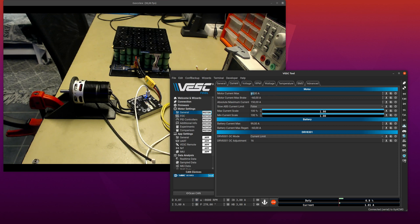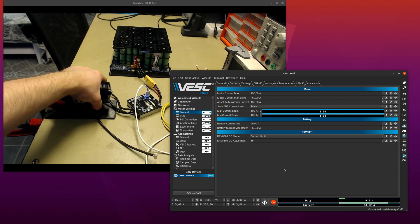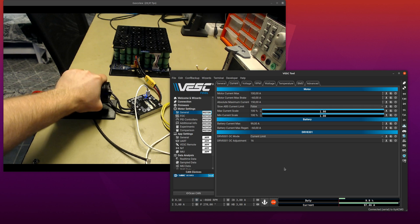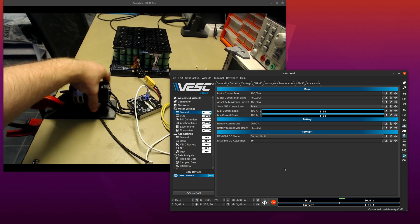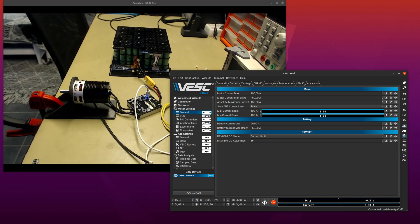Now we can actually do more than 60 amps — let's try 100 amps. We only went to 65 because I don't have enough duty here, let's do 10 percent. The full 100 amps and I can barely hold it now. But it tracks perfectly all the time. I'm using this on my kick scooter now and I cannot really tell that the motor doesn't have any sensors — it works as good or even better than hall sensors because we have a bit more resolution than hall sensors. I also compared it with an encoder and I think even at full load we tend to get within 10 degrees or so.